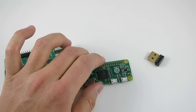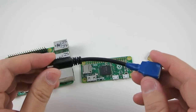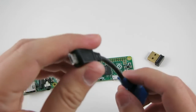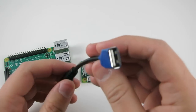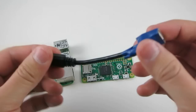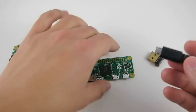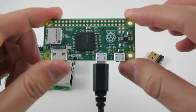I have ordered mine, but it hasn't come yet. So in the meantime I made a DIY version. I basically cut a micro-USB cable and a standard USB cable and pieced them together with some hot glue and electrical tape. Here is my DIY adapter — you plug one end into the micro-USB port.